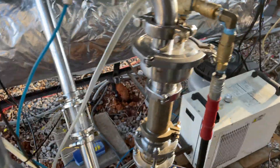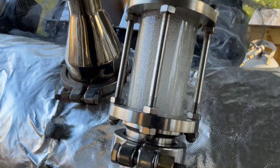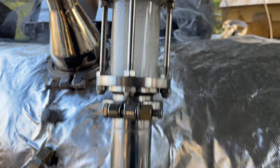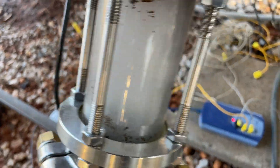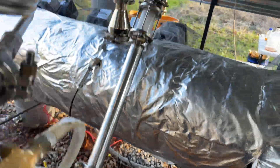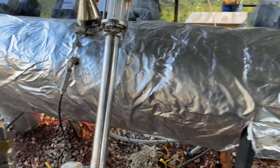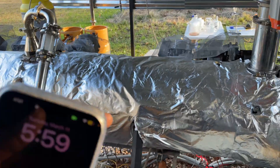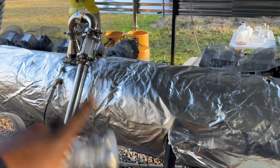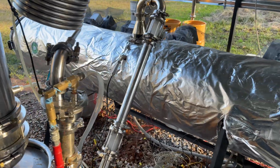I love sight glasses so much — look at how much moisture is forming, quite a good bit, very cloudy. Any moment now there's probably already oil inside the machine, refluxing — meaning it's condensing on the sides of the walls and staying in the chamber. But soon we'll see oils actually coming over. Water vapor is the first thing because water boils and turns to steam at pretty low temperatures compared to when plastic actually breaks down and does the same.